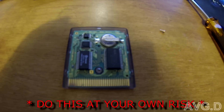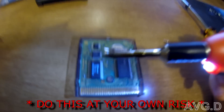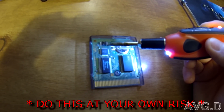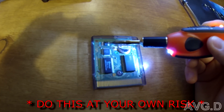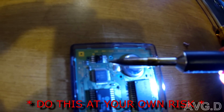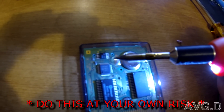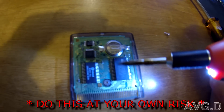All that means is, if you have your soldering iron, once it's hot, put it on the pin, wait for the solder to flow — you'll see it, you'll feel it melt underneath — and then go to the next pin, push down, go to the next pin. Don't spend too long on each pin; you don't want to cause any damage to the chip or drag the solder around. I did it first on this smaller chip here and that didn't remedy the problem. You can try it yourself, do one chip at a time — it's the easier of the two. If that doesn't work, then move to the larger chip and just go up and down each side.